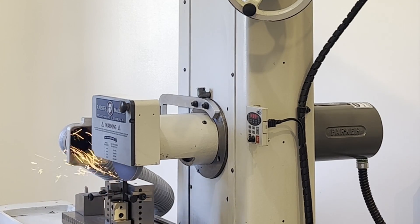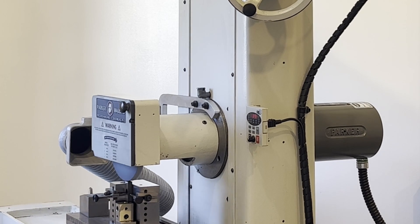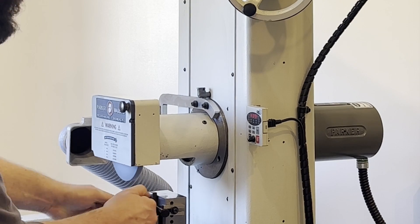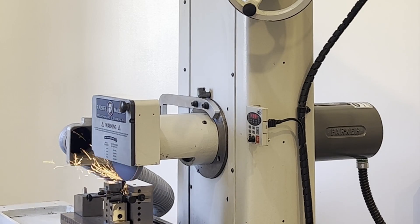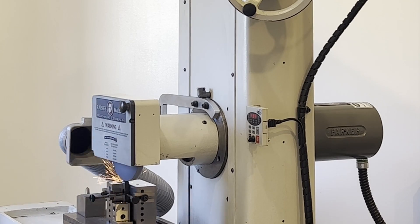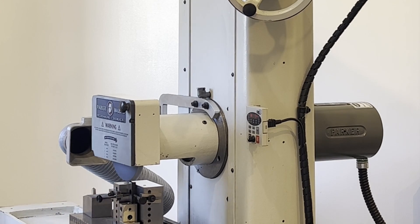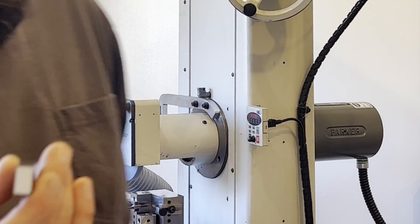You might ask, does this really need to be ground? From a dimensional standpoint, no — I could have ground or milled this prior to heat treat and it would have been fine. But the customer is laser engraving the ends, and I think it will look a lot better laser engraved on a ground surface. Also, I didn't have to do any finish milling when I roughed these; I just used a rough corncob end mill and sent them to heat treat. The Haas is almost never set up for finish end mills — it's just roughing and drilling in that machine, and the grinders do the important work. That's a very nice workflow. If you do manual grinding, give the peel technique a try — I really like it and it saves me a lot of trouble.